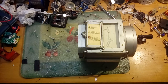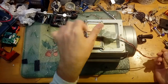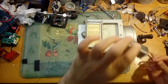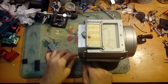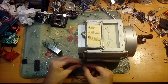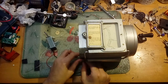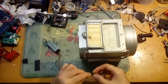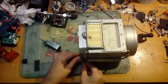There's also something I actually legitimately want to use this to test. For the 20 of you who watched the LED teardown, I was quite impressed with the quality of construction, however we weren't able to test the isolation between live and neutral to the output until now. So that is exactly what we're going to do - we're going to tie these together. This could damage the power supply, but I think it's a worthy sacrifice for education.